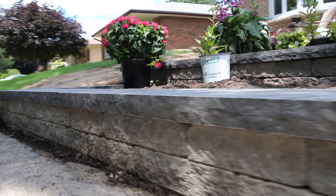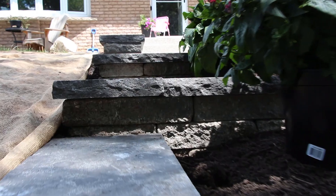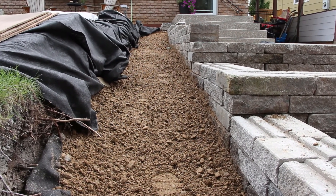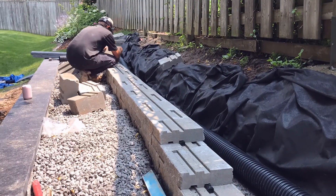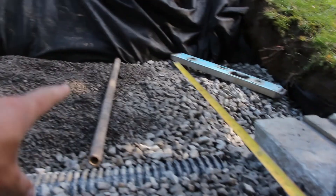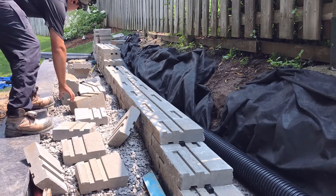It's in cases with no outlet where we'll use a dense graded base, because water will not soak as rapidly into the base material. We've got that three-quarter inch clean backfilled area where water is going to percolate down, hit our drainage pipe, and work its way through the face of the retaining wall or preferably out the sides. It's also important to note that the base material you use affects where that drainage pipe placement in behind the wall is going to rest. With an open graded base, the pipe actually rests lower in the base material in the drainage area, so water that accumulates will hit that drainage pipe and move out of the system.